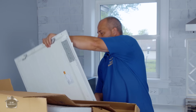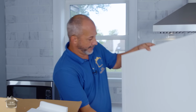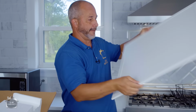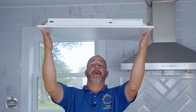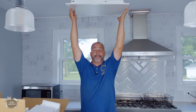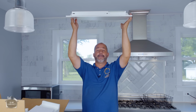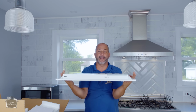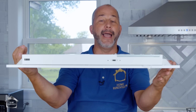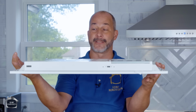And now they make a light just for you. This is set exactly to the right height. You build your drop ceiling grid, you can slide it up, drop it in, and you have an LED light in the room. So you can make this as a central room light, or you can pop these down a hallway every 6 or 8 feet, and you can have hidden LED lights in your drop ceiling. They're low profile, so they're really easy to install, and you don't need any more than the traditional 3-inch clearance from your floor joist to your grid to be able to install these.